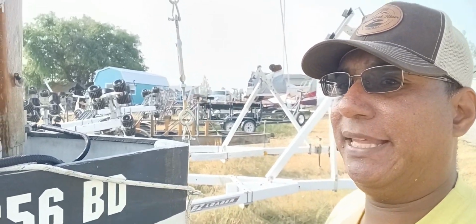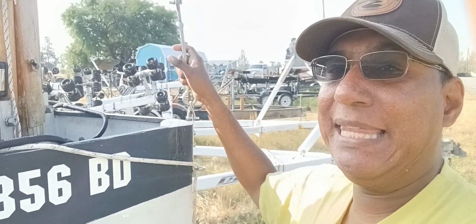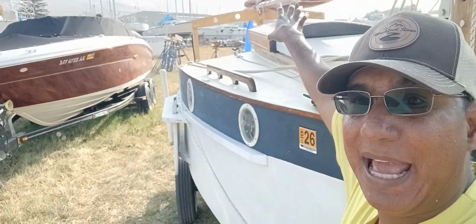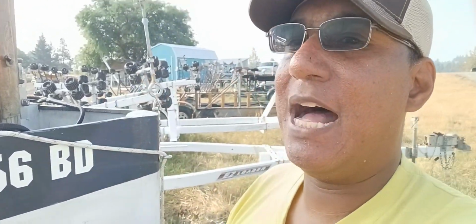This forestay on this design has proven to be absolutely a necessity. And originally, this isn't here. This is all my work here. But every catboat has a forestay at least. And the reason for that is because you have all of this weight back here that's being moved. And the difference when I don't have a forestay or when this forestay is slack is night and day.